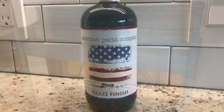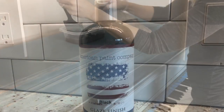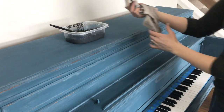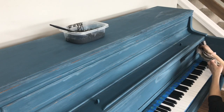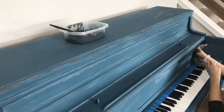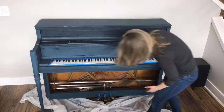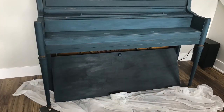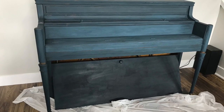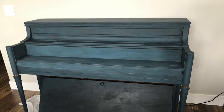At this point, I decided I wanted a darker tone to flow with my home, so I applied a layer of black glaze finish to the entire piano. I poured a small amount in a container and mixed it well with water in order to not make it too dark. I then dipped a dish towel in the glaze and rubbed it along the piano for a thinner application. Here is the piano with the black glaze. As you can see, the lower panel is darker because I applied that portion undiluted with a paintbrush before deciding to thin it out for the rest of the job.